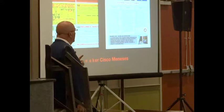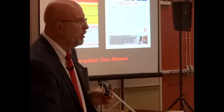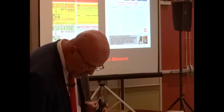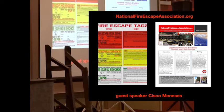Guys, lateral load test. There's supposed to be a frame here, so that I can tie my posts to a frame. This post is attached to two 1/8 pieces of flat. And this thing ties back to the house. Anybody can see on the front row, is that an 1/8 or 3/16? Front row. Yeah, it's an 1/8. These need 3/8 to tie back to the building. So this could be that.